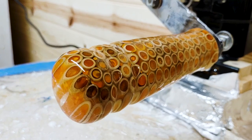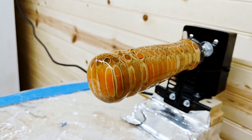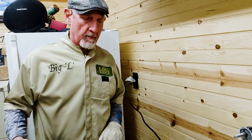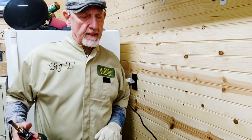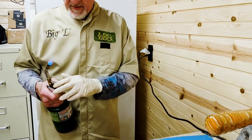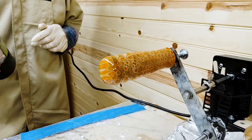I'm gonna let this sit for like a minute and I'm gonna torch it to get the air out of it, which I don't think there's any in it. You'll be doing the same thing on any table with anything you use epoxy on — you will be burning the bubbles out of it. I say burning, but you're not gonna burn it — you're just gonna flash it. You don't want to flash too much on this one or you'll flash it all off.